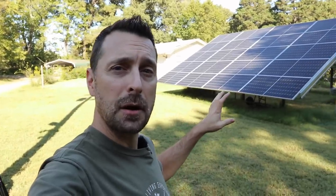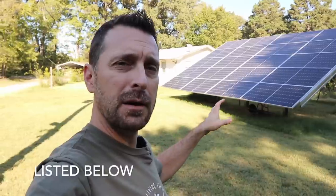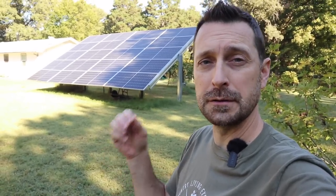You can see our panels are partially shaded because we have some huge trees around the edge of our property, so we get sun at certain points of the day. This was the absolute perfect spot to put them — it gets the most sun out of any spot on the entire property. A lot of people ask why I didn't put the panels on my roof. It doesn't get the proper sun, and additionally I did not want 400 holes in my roof, so the ground mount was perfect for us. These are 20 440-watt Solar Ever panels. Right now in early October, I'm only pushing about 80% efficiency, and you're not going to get peak efficiency all throughout the year, so keep that in mind.